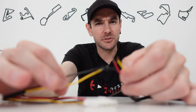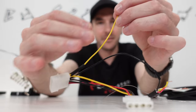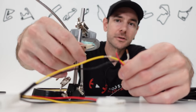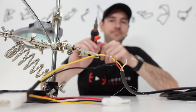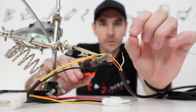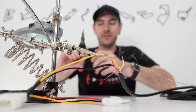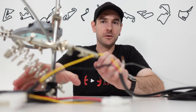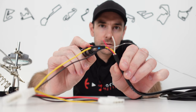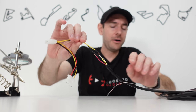Exactly the same thing with our yellow one — make sure it's not tangled before you twist them together, and make sure you've got your heat shrink on there. We'll grab our helping hands, get it nice and hot, wait a couple of seconds to get some heat into it, and run the solder onto the joint, not onto the iron. Make sure you don't breathe this stuff — it's really nasty. Ideally have some sort of fume extraction system as well. Take it off the helping hands, run our heat shrink over the joint, and shrink it on down. That is our 12-volt power running up to where our switch is going to be.